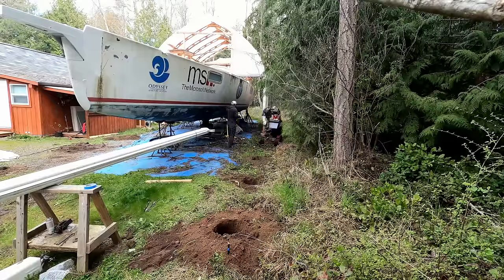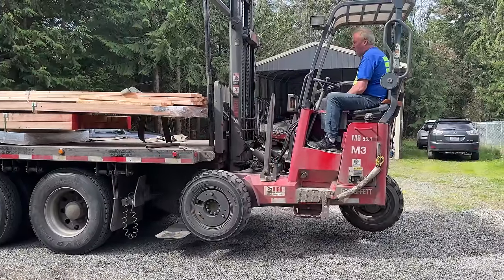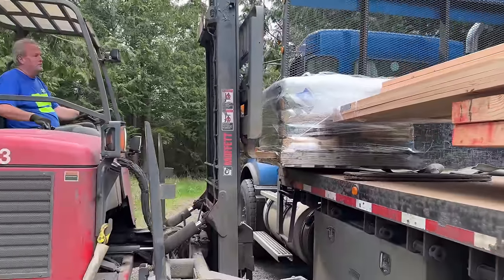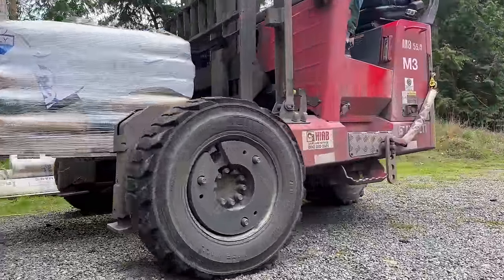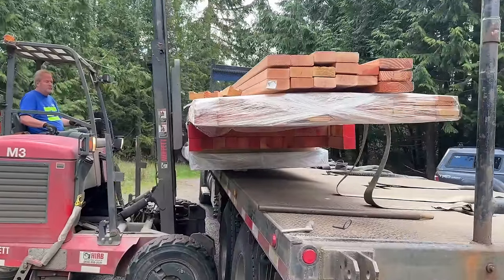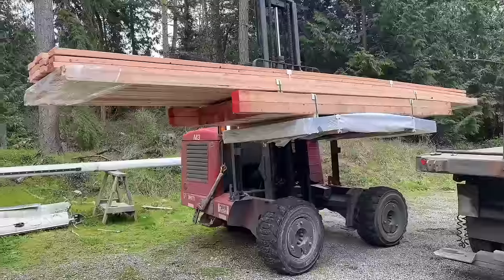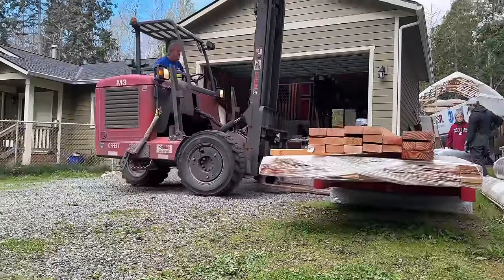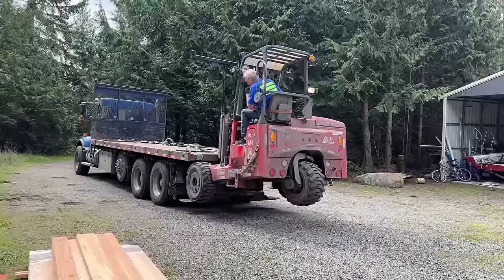We quickly got all 10 holes dug, just in time for the concrete mix and lumber delivery. We ordered 2,400 pounds of concrete for the footings, and a whole pile of lumber to finish out the shed. We're just using Douglas fir framing lumber to build the frames. 20-foot 1x4s for the frames, 4x4s for the posts and peak, and 2x6s for the ridge boards.